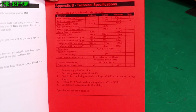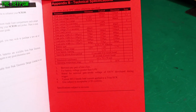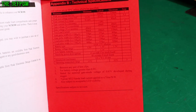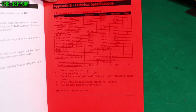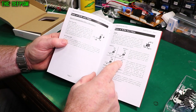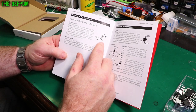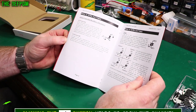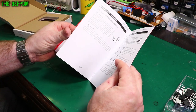The technical specs show information about the actual tests it performs, thresholds, and how it works. It does very short pulses — it puts a load to try and switch the gate with different currents for very short periods of time, so it shouldn't damage even a particularly sensitive device. A TRIAC is basically an AC device working in both directions, whereas SCRs or thyristors are unidirectional — only one directional, working on basically a half-wave principle. This tester can test those as well.